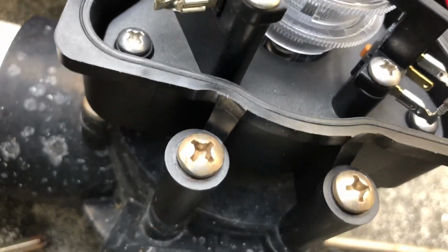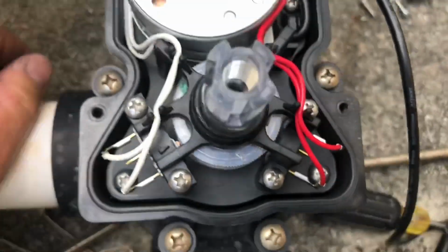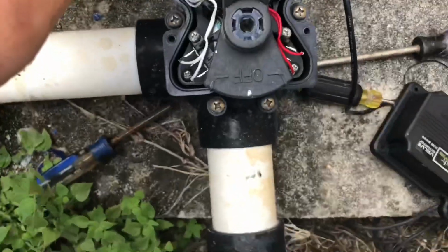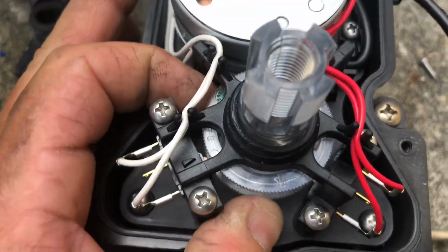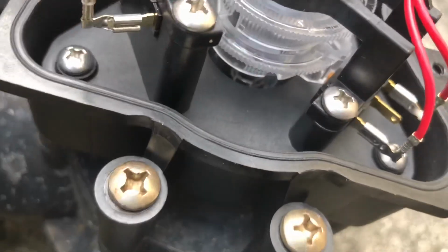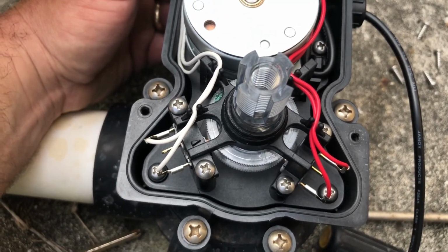Okay? So now you try it out. Look at the orientation. Remember, that smaller gap is the front of the valve. So if it passes it, see? Now look at the orientation of where this valve is. It's directly right on top of that. So I haven't gotten there yet. What I'm going to need to do is really advance this bottom one until it reaches that. See? Now it stopped. So I'm going to back it up and go forward and see where that actually hit.